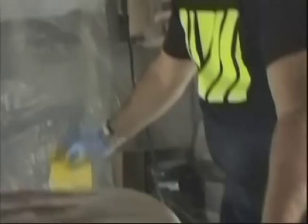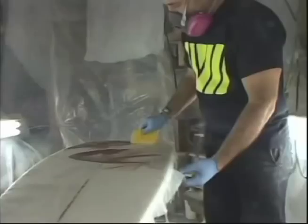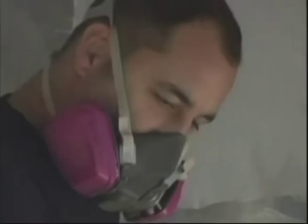You almost can't press too hard now because the glass is really down, and it's this taut connection on top of the board that is going to make it nice and stiff. The tighter you can get this, the less waste — meaning extra resin — the better. I always move from the middle out, pull it over the edge, and let the gravity do the rest.